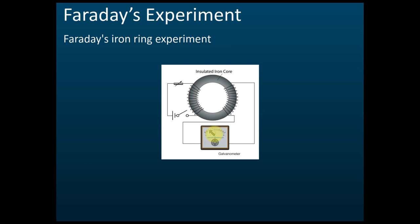Just at the moment the switch is on, it deflects a little bit and then back to zero. Then when he switches off the switch, at the moment he switches it off, the galvanometer deflects again — this time to the right. After that, it goes back to zero. So the directions of deflection are different: switch on, deflects to the left; switch off, deflects to the right.